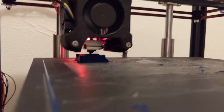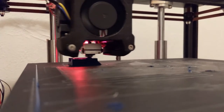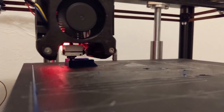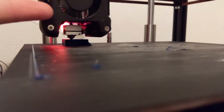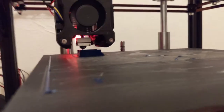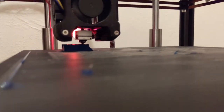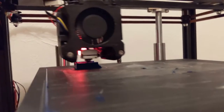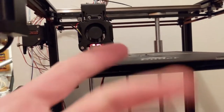Installed on the printer and doing a little test print — the heat block is working. You can see the little set screw sticking out the top; that's a bit of a problem because you can't access that screw and you'll have to disassemble the entire hotend just to swap out the heater cartridge. But it's better than just throwing the entire block away. It works, it prints, it holds the temperature pretty well. I'd call this one a win.